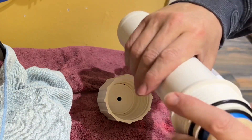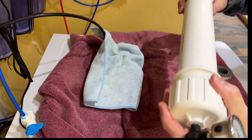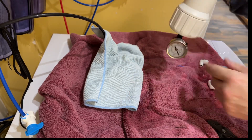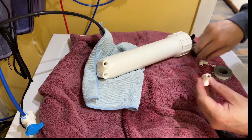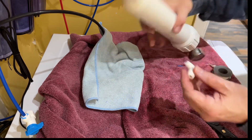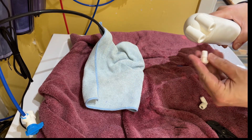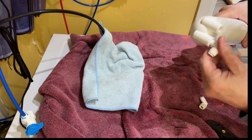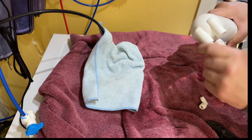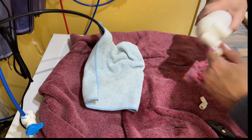We'll take our new membrane and press it in all the way. Screw the cap back on hand tight. We've got two different fittings here — one's an elbow and one is a check valve. The check valve is on the good side. I'm going to screw this in fresh. I applied a little bit of Teflon tape in there because they seemed a little bit loose after all these years. I like a little better grip — it feels good. Give it one extra twist.